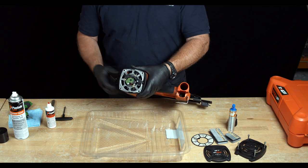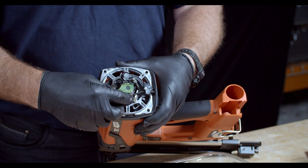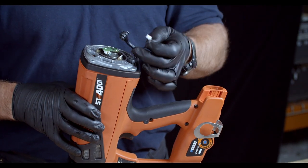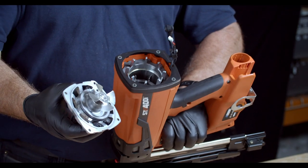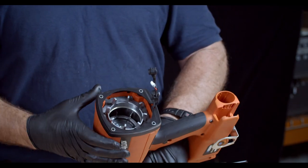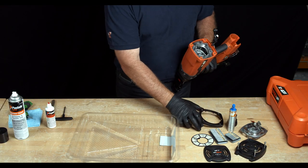Next, that's going to reveal the motor. There's a black wire that you want to remove for the spark — simply pop that off. The wire on the opposite side runs the fan; you want to unplug that. Put your fingers into the grill and gently remove the fan assembly and place it on the side blades up. Remove the black spacer cap and set that off to the side.